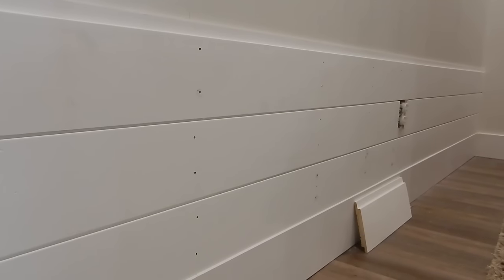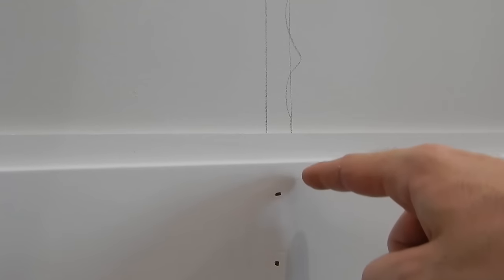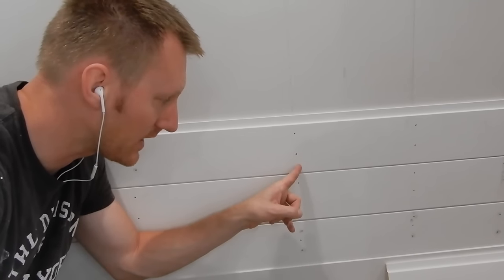I've put too many nails in these boards and I just realized that all I need to do is — once I put another piece right here over top of this one — just put one nail on the bottom and keep going above it. So save yourself the time and nails by only putting one nail where the tongue and groove come together, and you'll also have fewer holes to fill with wood putty later.